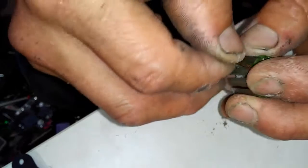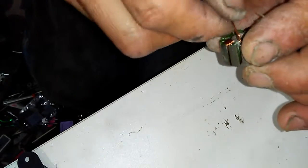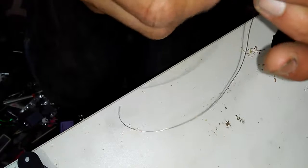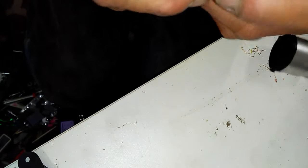We're going to go counter-clockwise on this one. I consider it a complete turn when I have the wires coming up towards me. On the other teeth it's when I'm pulling down — that to me is one turn. But this is the last tooth, so the end of a complete turn is me pulling these wires up. If I'm pulling the wires down, I still haven't had a complete turn yet. That was two, three — and then I'll do it all and get back to you.